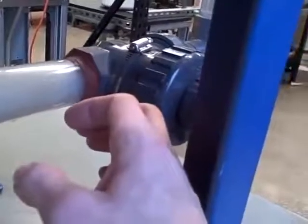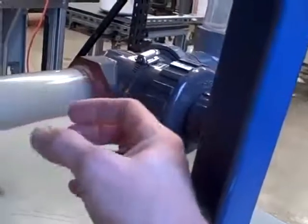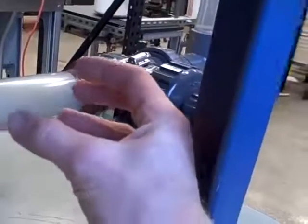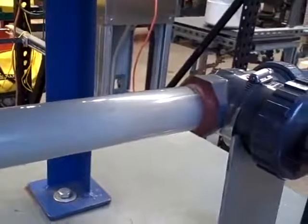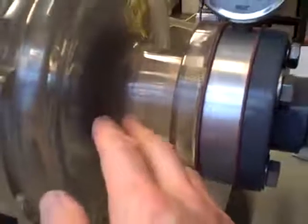As the water goes through the valve, it reduces pressure going to the restricted valve. Its pressure drops below the vapor point of the water at this temperature. It flashes into steam, and then after it comes out of the valve and expands again, the pressure goes up, and what happens is those vapor bubbles collapse back into liquid, and that's when we get the cavitation effect. We can see it happening here. We can also see some bubbles here in the scroll casing of the pump.